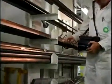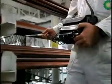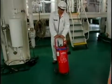Among the essential permit requirements are the performance of flammable atmosphere tests at the work site before and during the task, clearing flammable materials and fire hazards away from the work area, using fire blankets or water spray to contain fire spread, staging firefighting appliances at the work site, and the deployment of a trained fire watch who monitors the work on a continuous basis. Hot work permits must be approved by the master or chief engineer.